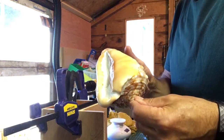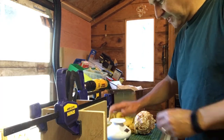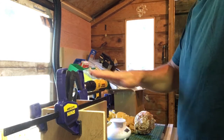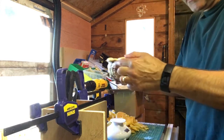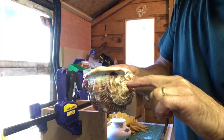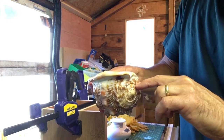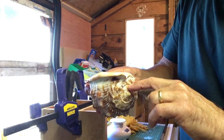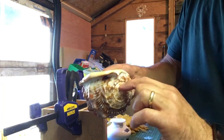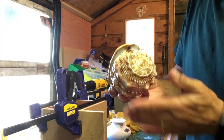I'm making a start on the mould for the fighting conch. I've given it a coat of the release agent — I don't know if it'll dry but it should still work. I've got some scrap silicone to cut up. Basically I've put in about half an inch of silicone mix with some scraps just to create a baseline because I need a bit of thickness for this to sit on. So this is going to sit on those four points, and I'm going to fill the mould up to this level here. I need the split line to be at this point, because I'm making two moulds to create two halves of the conch. So that's the biggest pour and I'm going to do it next — just waiting for the base layer to go off enough to support the weight.